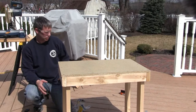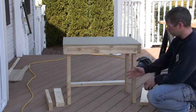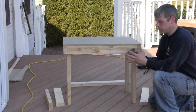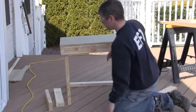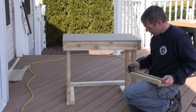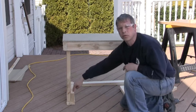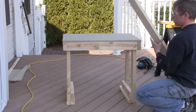Now we're going to start working on the bottom assembly to get some mounting spots for the casters. I'm making some changes as I go — I want to have some kind of cart underneath that the casters can bolt to and that keeps the legs from flexing. I cut 2x4s at 21 inches long and they sit under the bench like that. Then I took two more cuts at 18 inches for side support, and put a carriage bolt through the bottom leg with wood screws to hold it tight. I also took a piece to go across the back, cut at 31 inches.